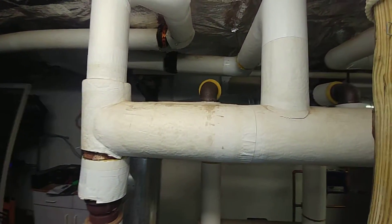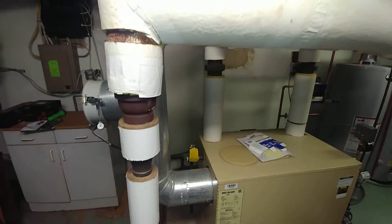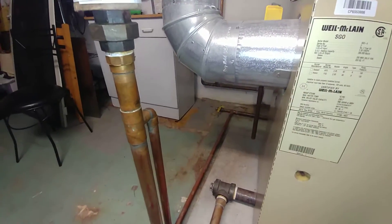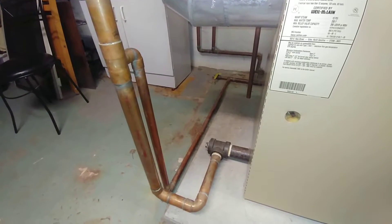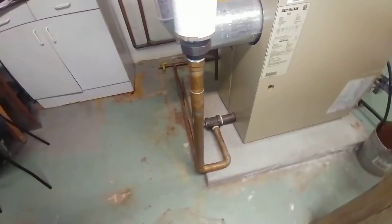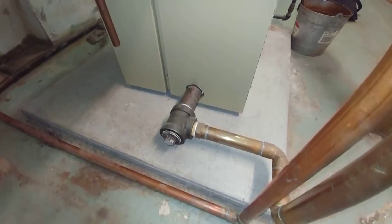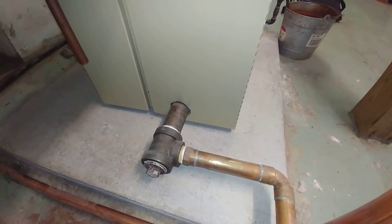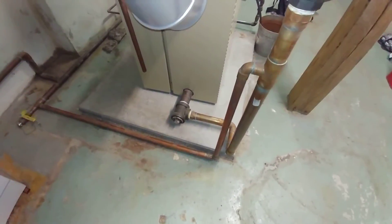We had to do a lot of flushing in years past because of very dirty water that contaminated the system, but we're finally getting that straightened out. This is something we do a little differently than we did in years past — I no longer make the equalizer line out of copper anymore. It's now made out of iron, brought into a cast iron tee for flat cleaning, with an extra-heavy nipple to tolerate the electrolytic action.